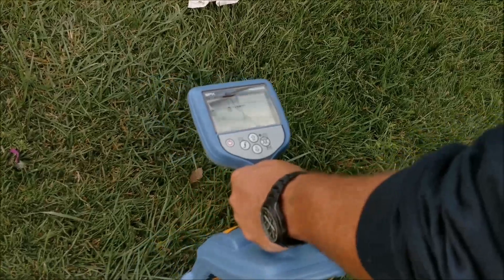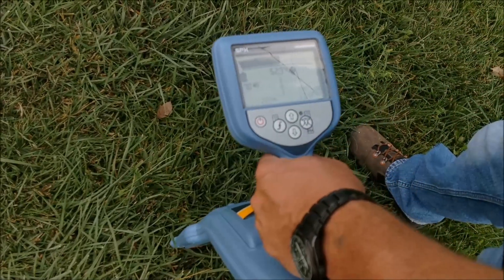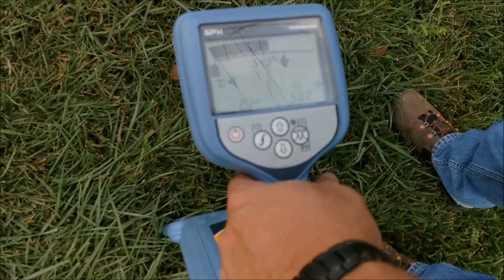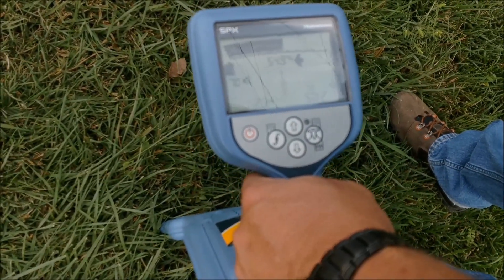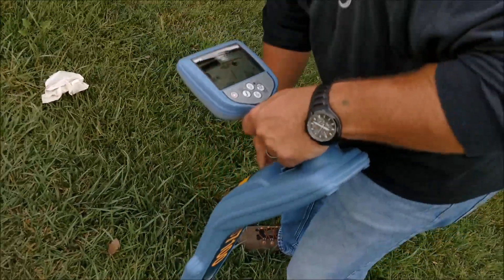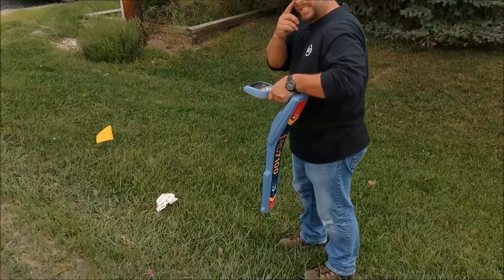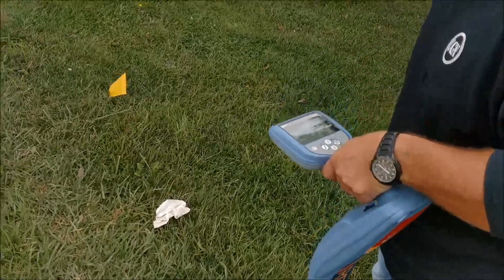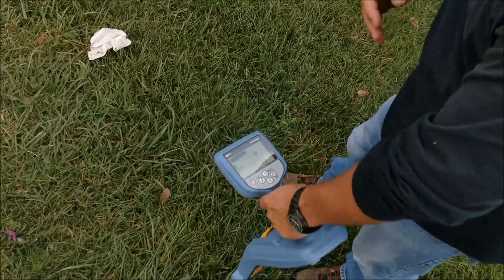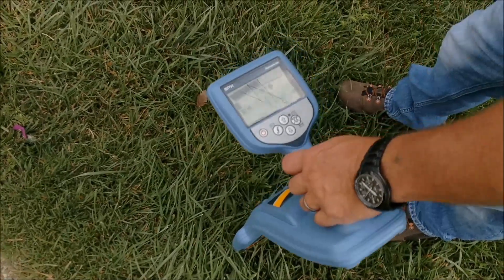As I go left and right, you can see my numbers going up and down, and the arrows also help guide you left and right. Numbers are always the most accurate way to locate, but the arrows on guidance mode do pretty well too. You can see the arrows getting smaller as I get over the line, numbers getting larger — they are both telling me it's right there. My depth reading will show up when I get close to the line as well: five foot two inches deep. To verify that depth, we can lift it up exactly a foot, and it should add exactly a foot to our depth reading — and right there it's saying six foot two inches deep. If it adds exactly a foot as you lift it up a foot, that verifies your depth reading is probably within the inch and your locate is accurate.